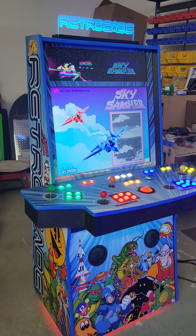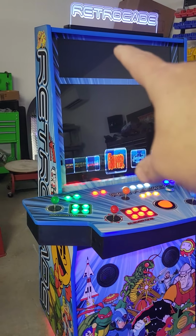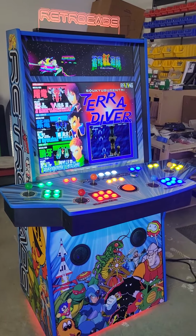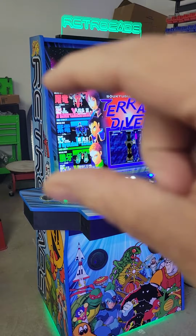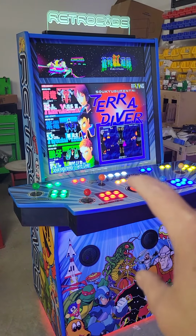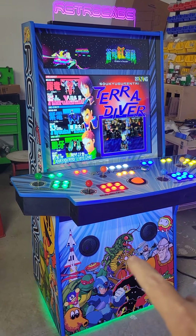It actually has a 55-inch vertically mounted screen. So, if you look at it, this is the top of the screen. We put a divide. We spaced it out through the software and CAD for the bezel so we could place where the horizontal portion of the 4x3 area is along with the active marquee. With the 55-inch screen, bottom of the bezel, 38% of the 55-inch screen actually goes in the bottom of the cabinet. And just a tad around where my finger is.